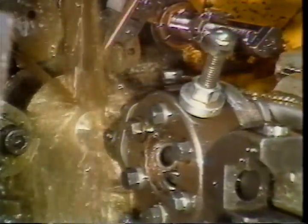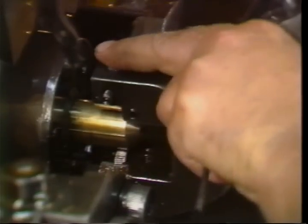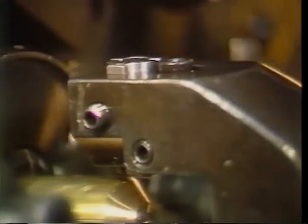You can now start the machine and stop it before the knurling operation. Hand crank the turret to the top of the knurling lobe. Push the roller down on the bar stock and snug down the set screw. Now back the turret away from the bar and turn down the depth screw a quarter turn.